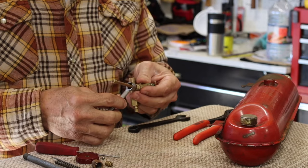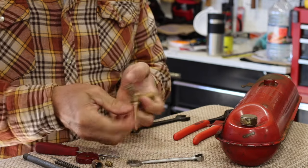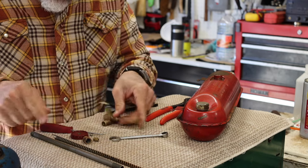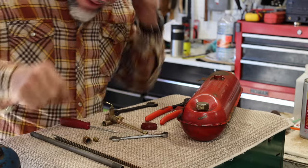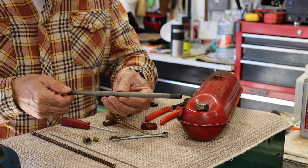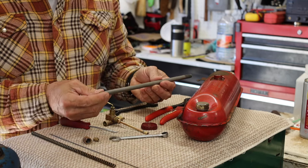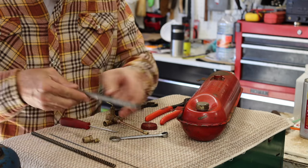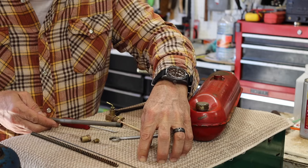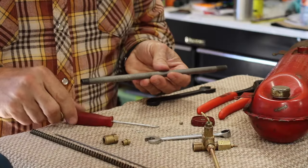So that's a 3/8 - I'm going to tighten it up decently. That's working properly, real nice on the end there. Next thing I want to put together is this generator. This goes to that. Now when I took this generator part, the spring goes in - I'm putting it back the same way. This end right here, you see these threads - it's long and tapered. This side is the tip end that goes into the burner, and this side is going to go into the valve.